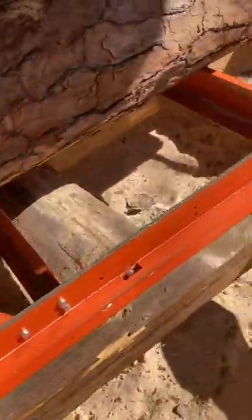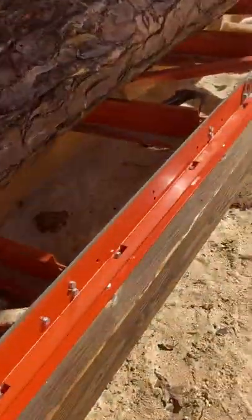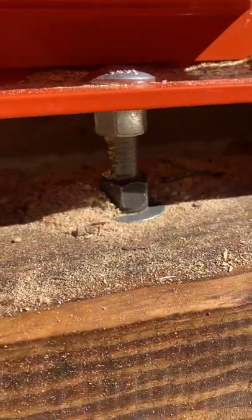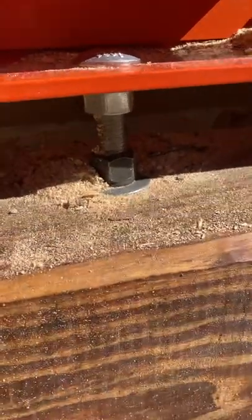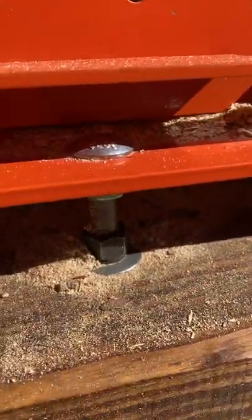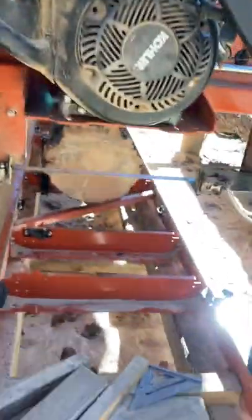The bottom of my mill — I've got some six-by-eights and it's reinforced about every four feet with either a brace in the middle or legs on the outside; I did both because it seemed convenient and helps distribute the weight. I also made my own leveling feet — I didn't see the point in buying the ones Wood-Mizer offers. I went to the hardware store, got some bolts, carriage bolts, a couple sets of nuts and washers, drilled holes into the support board, and by moving that nut up or down I can raise the mill to level it. That was the only other thing I did that didn't come factory.